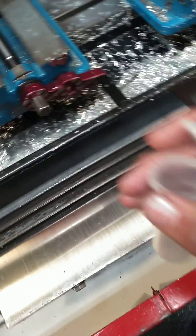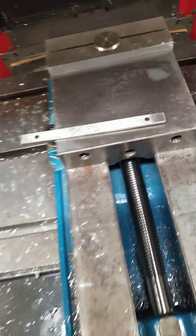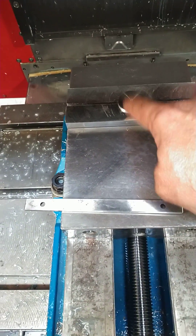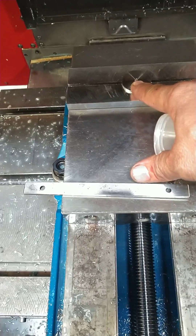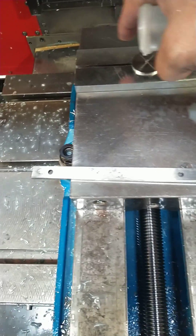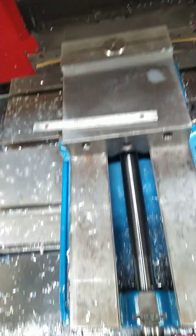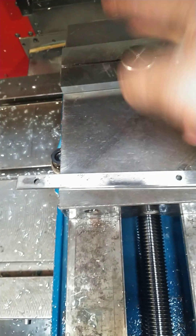Already bleeding and I haven't even started the project. So I'm going to show you how I go about this — I've had to do this a couple times before. This right here I've already indicated in. I'm going to bore that out and make it a press fit for the ball. Then I can indicate on the outside — this will be my sub-fixture basically, in soft jaws. I'll drill halfway, flip it over, and drill the other halfway.